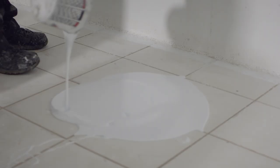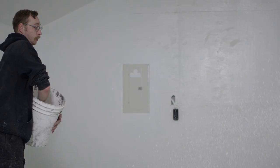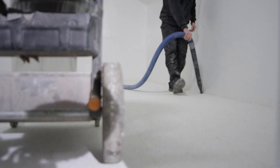Then we're going to take and do a base coat with super white, make sure it's white. Then we're going to broadcast flake white as well. And then once that sits and dries for a few hours, we'll come back and scrape it to give it a really nice texture — it's walkable, but it's safe. Once that's done, we're going to vacuum it all up so there's no leftover flake that's not adhered to the floor. And then we're going to clear coat it, top coat it with another super white, just to give it that white gloss.